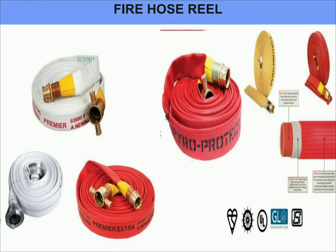First, we are going to see fire hoses. Hoses are one of the basic and essential pieces of firefighting equipment. It is necessary to convey water either from an open water supply or from a pressurized water supply. The usual working pressure of a fire hose can vary between 8 and 20 bar. They are classified based on the material used for construction. Coming to Type 1 and 2 RRL or canvas hose, their features are that they are percolating in nature. Hoses can be basically classified into percolating or non-percolating type; the percolating feature expresses the porosity of the hose. Percolating hoses are generally used to fight against forest fires.